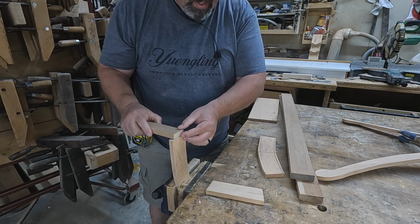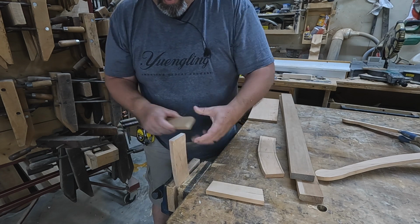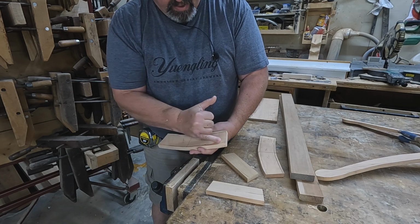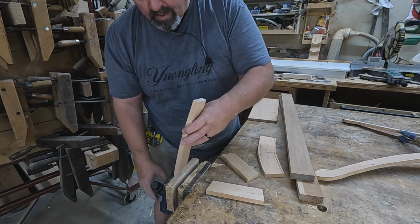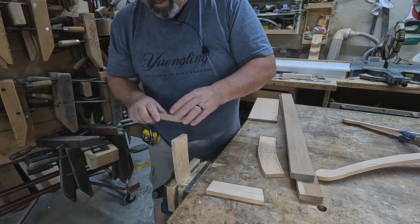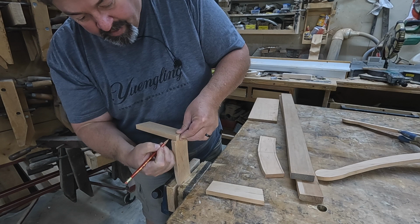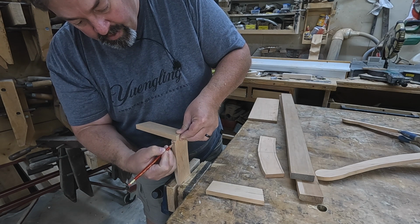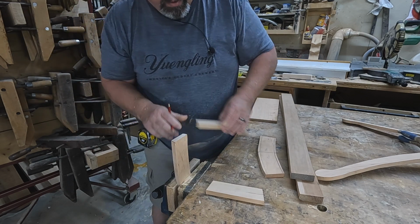And our cleats are going to run like this. Now, we've cut these wide again, so you can see how I'm going to orient this and line this all up. I still have my cut lines where I want to end up. So that's how I'm going to do it, and again, we're just dry fitting at this point. We're not permanently putting these on. So I know I want to put a back bevel, maybe a degree, even a half a degree, because we want that stretcher to sit back here a little bit.